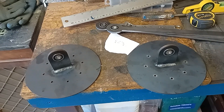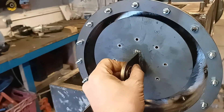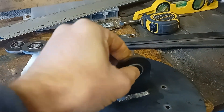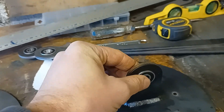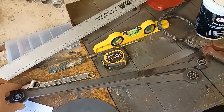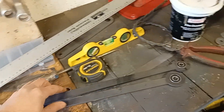These are the piston assemblies, so to speak. So these will be going in and out with the diaphragm like that. I've welded these pieces on and put our bearings in — these are held in with Loctite. There shouldn't be too much heat getting to this area, so I think they should be fine. And the same with the crank — the connecting rod side — I've put the bearings in and held those in with Loctite.